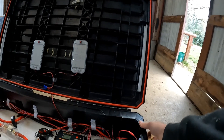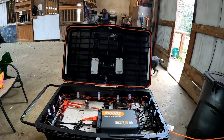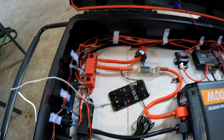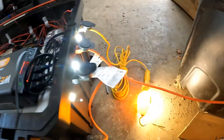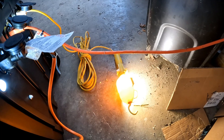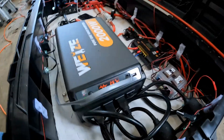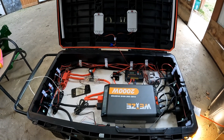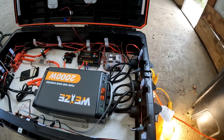We'll plug a light in and see what that does. Going to turn these perimeter lights on. For my setup right now: I've got a phone plugged in charging, a stopwatch going to track how long we run, an LED light in here — probably eight watts, maybe ten — plus the freezer and refrigerator. That's reading 267 watts right now, and I've got 2,400 watt-hours for this system, so we should be able to run around 10 hours at that rate.